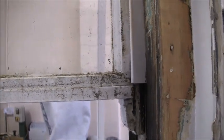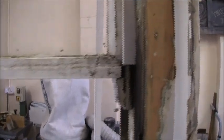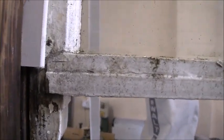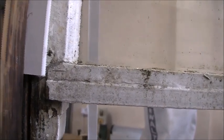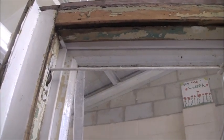So that's my next thing. Basically, I'm going to shoot the sash up and down a few times, and then I'm going to trim that off. Okay, so I've trimmed that now so that it should pass by. I've moved the sash up and down several times, and I know that this side still has just about enough clearance. If it turns out when I'm moving it up and down later that it hasn't, then I'll adjust it, but for the moment it's okay. Now at the top, I've left little tabs of the brush. Until I've actually got the bottom in, I'm going to leave those up there.